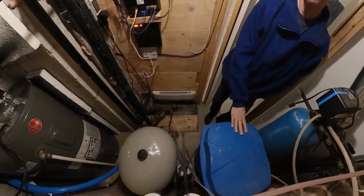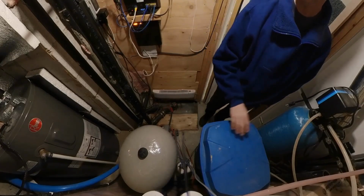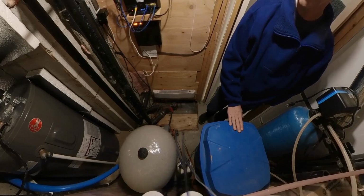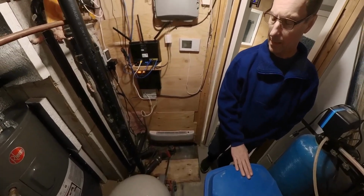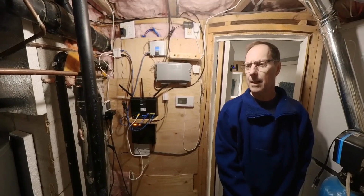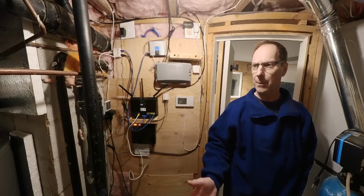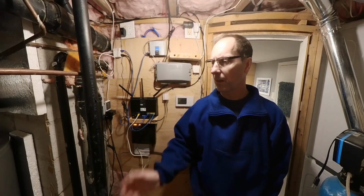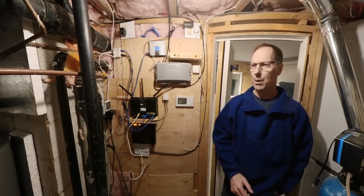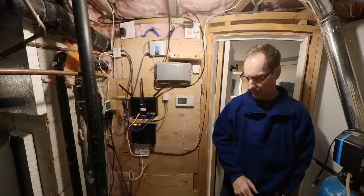I assume it had some kind of chlorine or peroxide in it that was on the beads that would transfer to the water and would keep this in check. We're no longer able to get it, so I'm going to try the peroxide cleaning method. The issue I've got is we turn the water heater off and on a lot when we go away from the cottage. The smell, I think, is going to be fairly intense as the bacteria regrows. So I'm trying to come up with a way that is as toolless as possible.